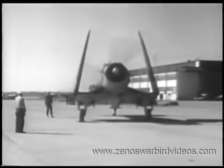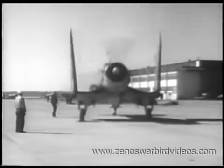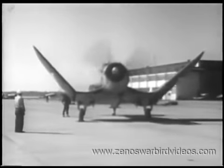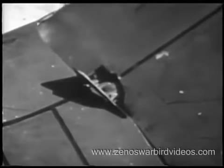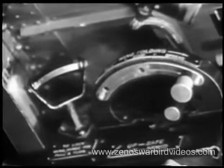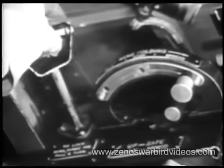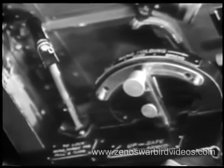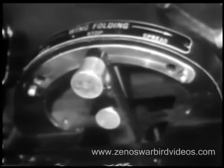The wings are spread by moving the hydraulic control lever to the spread position. When the wings are fully extended, the small doors at the wing joint close, indicating that the hinge pins are in position. Then these hinge pins are locked by pulling up on the D handle and turning it clockwise. This will silence the warning horn, which blows throughout the last seven degrees of the wing-spreading operation.